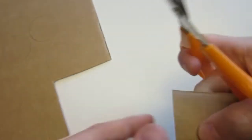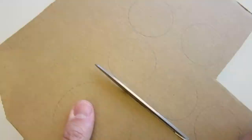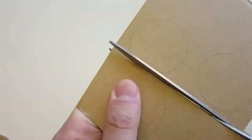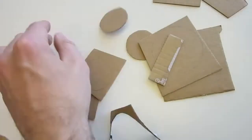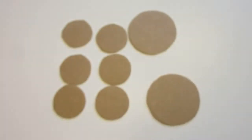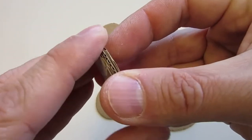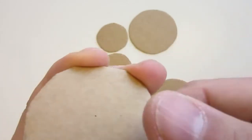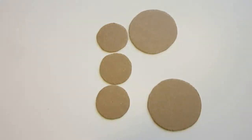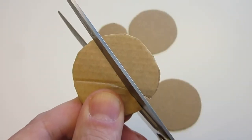The plan is to create 2 sets of 4 wheels. One set made of one bigger wheel that will act as a guide, and 3 little ones that will act as drivers for the moving arms we will build later. We will then cut notches on the small wheels corresponding to our required number of clicks and click timing.